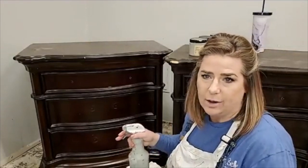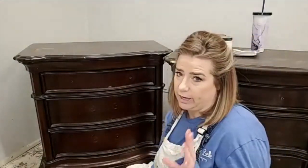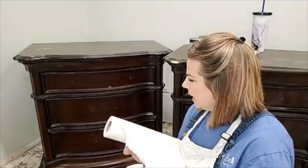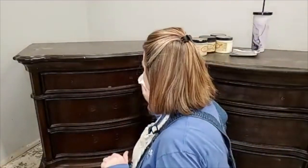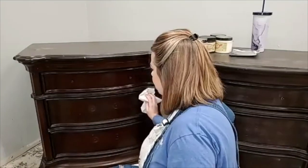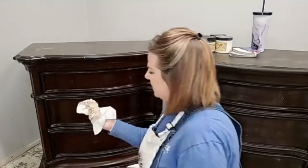The next thing you want to do is clean your piece. Always take your hardware off and always clean — those are steps you don't miss on anything. This is Dixie Belle White Lightning, which is a granulated formula that you dissolve into water. I dissolve mine into a spray bottle and use it over and over again. You can use an abrasive like a scotch pad. I'm evaluating my pieces as I'm cleaning — looking for things like how it's cleaning and whether it's likely to bleed or produce tannins.